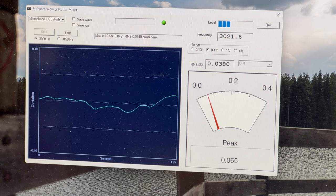I decided to make an executive decision and do these in audio grade parts as well. These are UFW parts from Nichicon, and they're C207 and C107. So hopefully they work out, but yeah, all the capacitors are done now, and I have to try and get this switch panel off now. That's going to be fun.